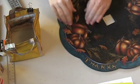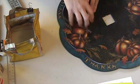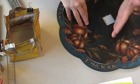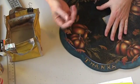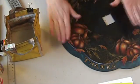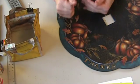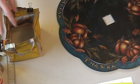One of the things that can happen when you wet sand is you will see, almost like when you scratch on a dry, pre-varnish surface, some hazy, dusty looking surface, like you did just sand. What you do after you get done wet sanding is you apply one final coat of varnish, or you wax. And so that'll take us to our next conversation.